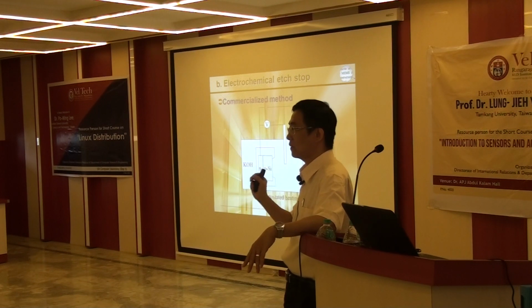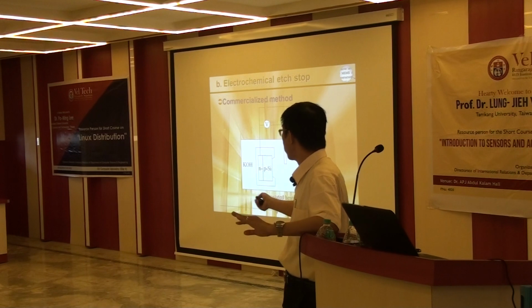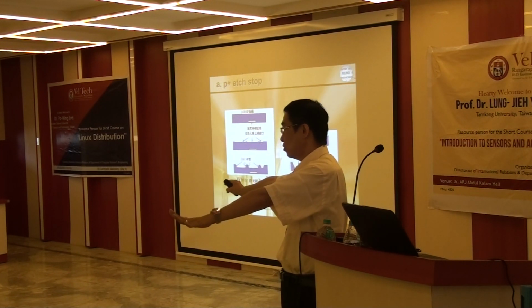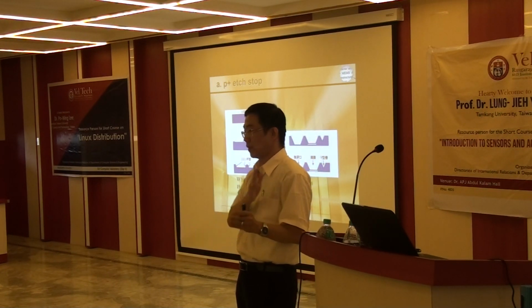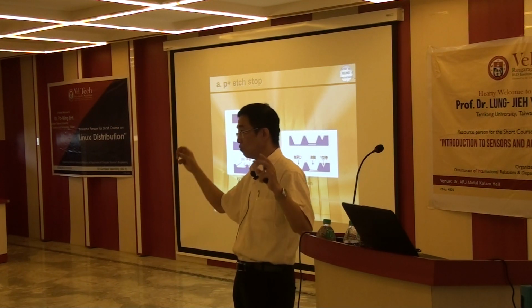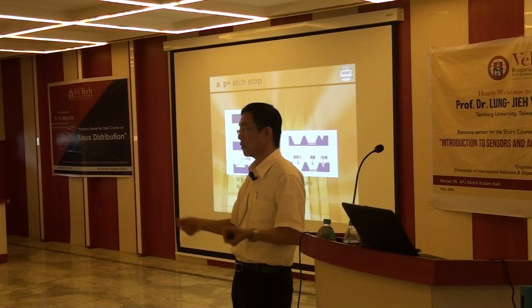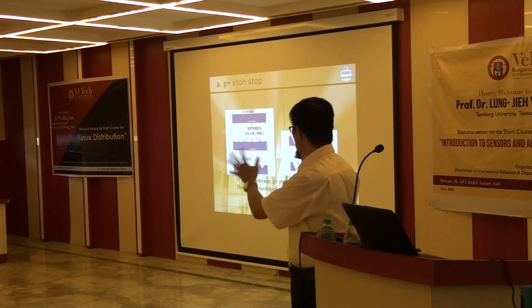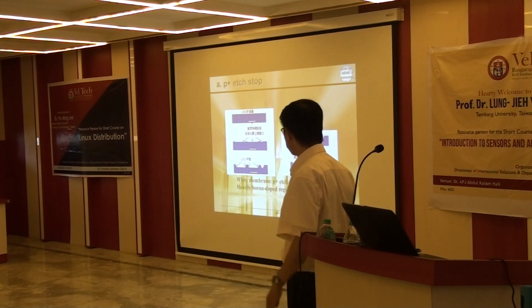If you want to do mass production, it's a little bit hard. It's not batch. For the P plus, you can do it in batch. Why? Because we can put 25 pieces, 15 pieces, into the diffusion furnace together to do the diffusion. So it's a batch process. We don't need to separate it, and you can set the time and see the cost.